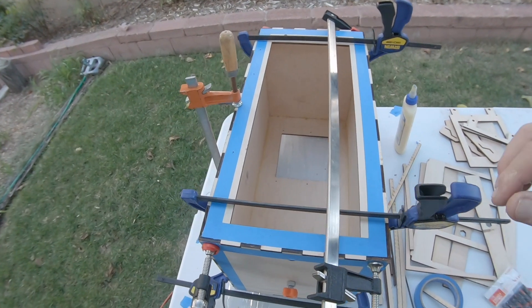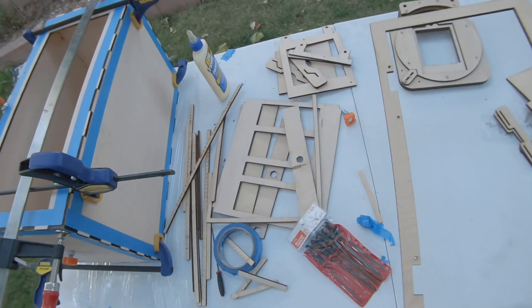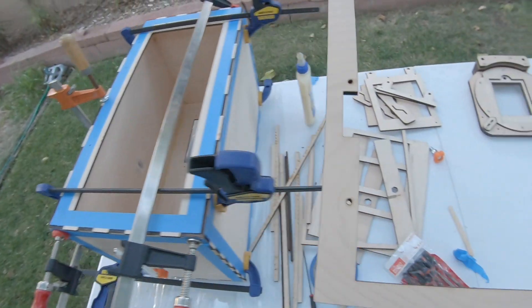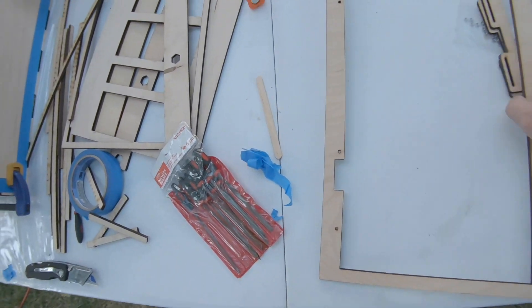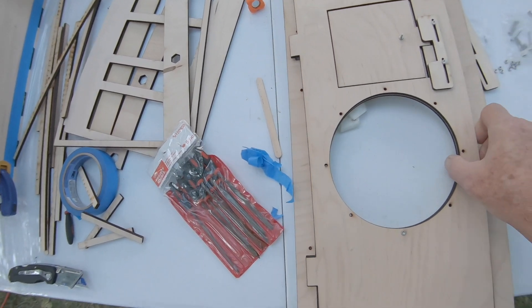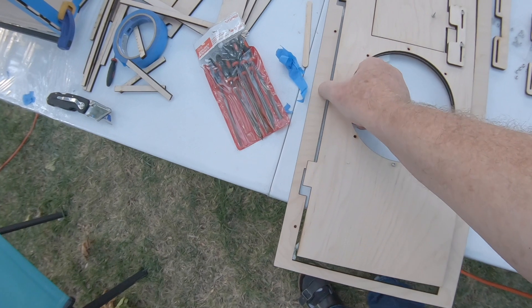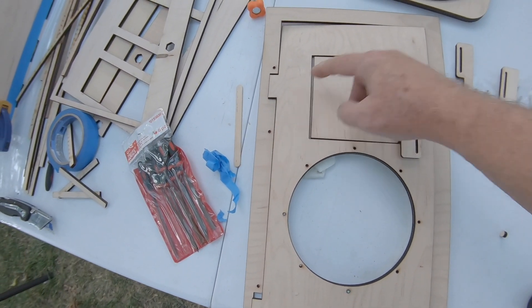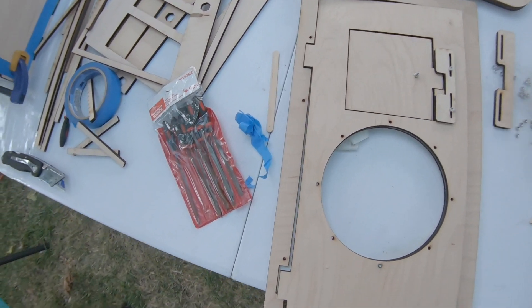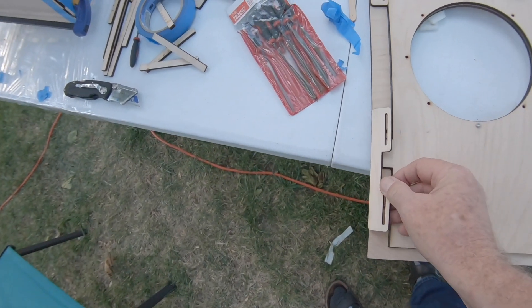Let's take a look at some of the sub-assemblies we still have to glue on. First, this is the back flange — the rear of the camera. It has a piece that's going to be glued onto it here. You'll notice these cutouts and screw holes. The actual hinged lid will be situated here, with a piano hinge along here — it opens to the right. There will be a hinge on the peep sight door, a lock to unlock the door, and two sliding locks that keep the door closed on the left side.